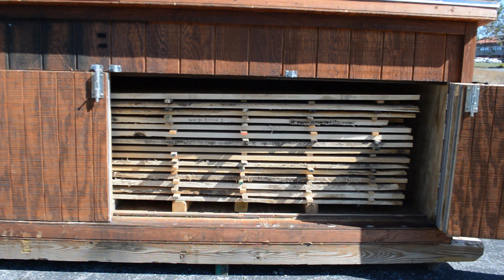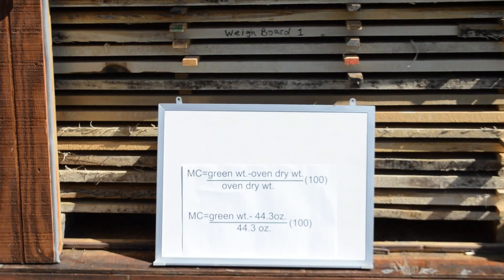This value is used to calculate the moisture content of the weigh board and the rest of the lumber stack as it is being dried by the dry kiln. We have placed the stack of lumber in our dry kiln. As needed, we will re-weigh the weigh board to determine drying progress. We calculate the moisture content of the weigh board and lumber stack using the moisture content formula. The actual weight of the weigh board each time we weigh it will be the green weight, and the calculated oven dry weight of 44.3 ounces will be the oven dry weight. We check the drying progress weekly until nearing the target moisture content, and more frequently as the target moisture content is approached.